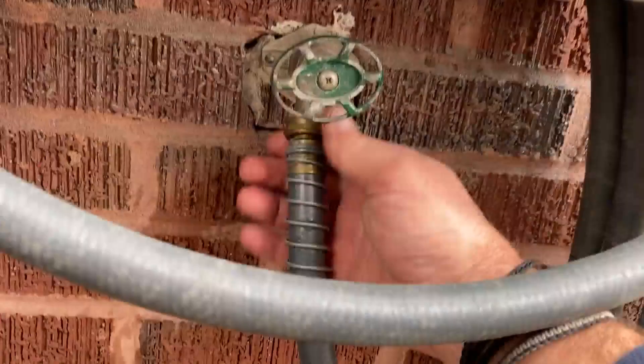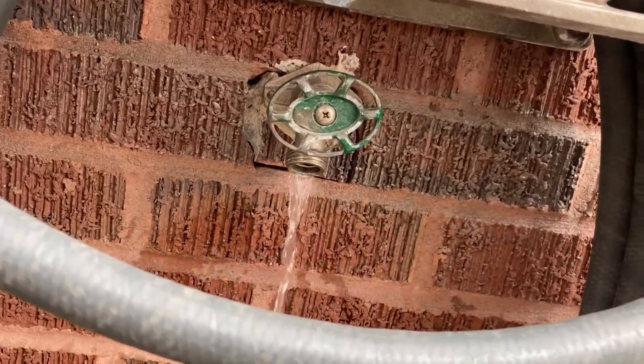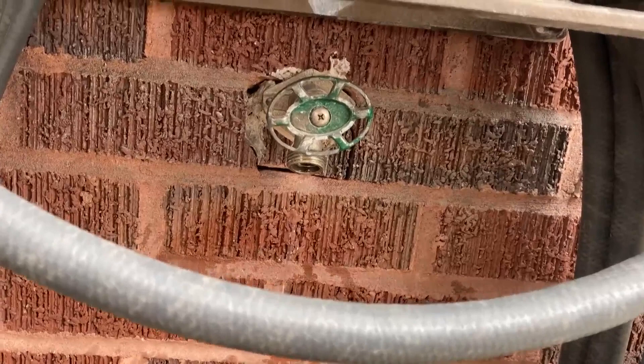How many of you still have the garden hose stuck and hanging on there? Watch as I take this off. This is a frost-proof nozzle, and see the water that comes out? If you don't drain that out, that water will freeze inside that wall. The spigot won't leak, but when you go to turn it on in the spring, there's a pipe right there that can burst. All of a sudden you're out there watering the grass in the spring and somebody screams there's water all over the basement.